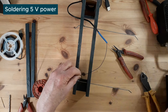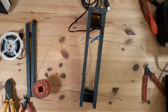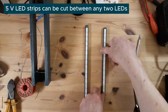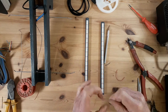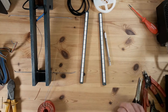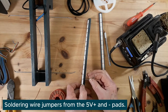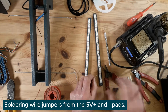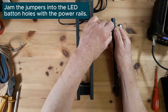I've got a pair of bus bars going out where we're going to hang the LED lighting strips. On the left of the screen, we're going to use the suspension wires as the conductors. Here I'm soldering two little tails — one onto the positive and one onto the negative track of each of the LED strips — and pushing the wires into the same holes that the suspension wires use to hold them on, so it's just a friction contact.